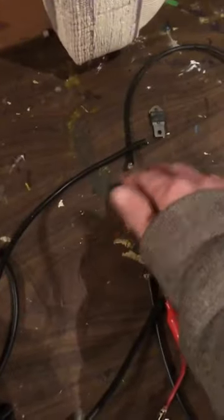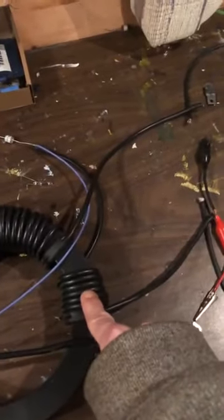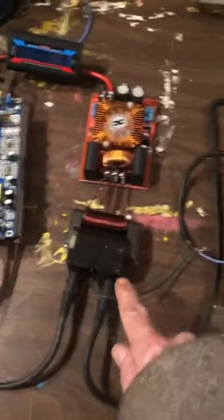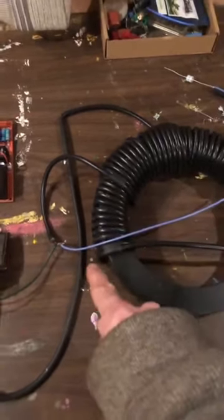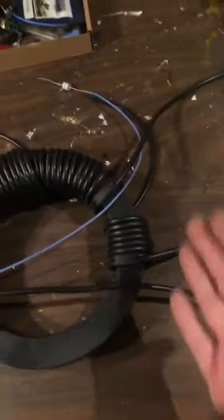After that it goes to these rectifiers I've ordered — I've just placed these ones here to represent them. There are two of them going there and a common ground, but this is not a ground. This is the second neutral plane at a higher potential than the first neutral plane, and they are center-tapped from the end of the primary coil.